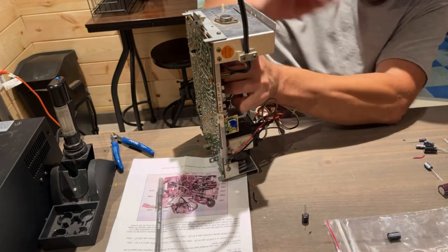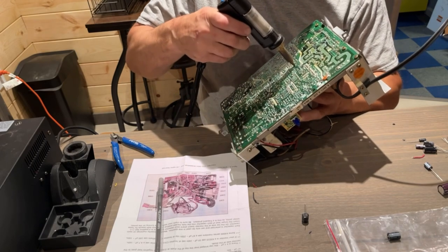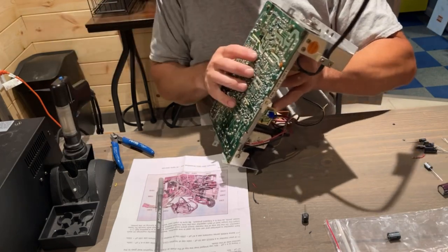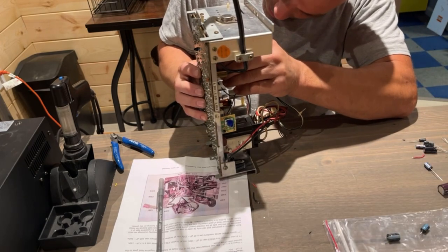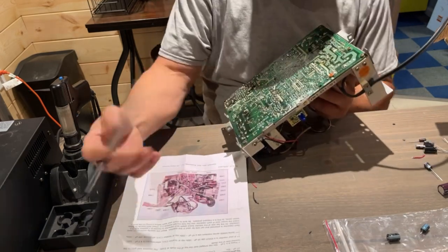Right there. Pop this one out. Looks like all the pluses are going towards the floor when I stand the chassis up on end. But we'll still verify it. Yep, negative's going up. Now this is cap 205. We'll mark that off the list.